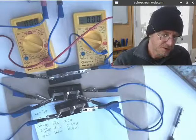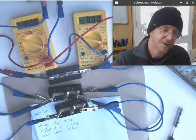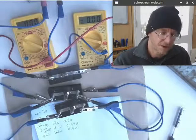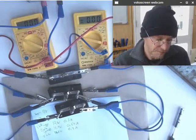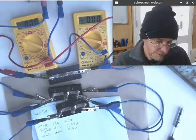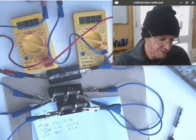And so this is why we need safety features in the wiring systems of our houses to prevent the accidental supply of too much current, because as you can see in these light bulbs, the more current we supply, the hotter they become. Now, nichrome wire is designed to be like that deliberately, but even copper wire heats up if you put too much current through it.